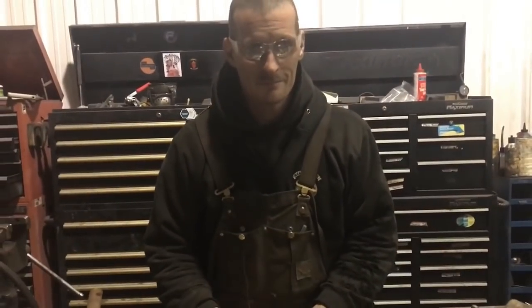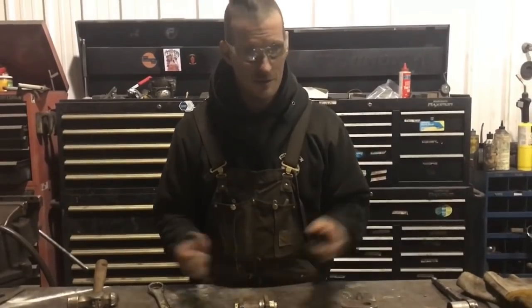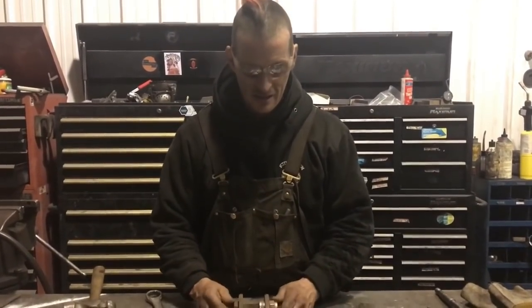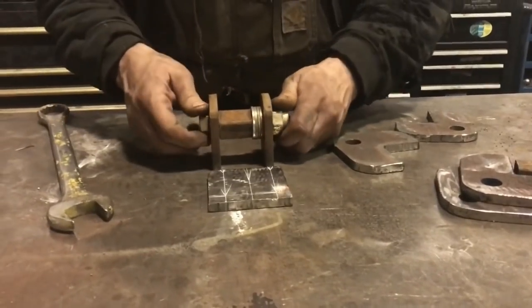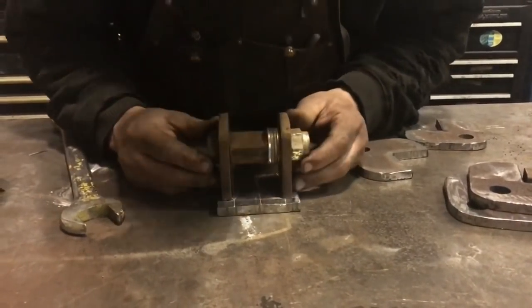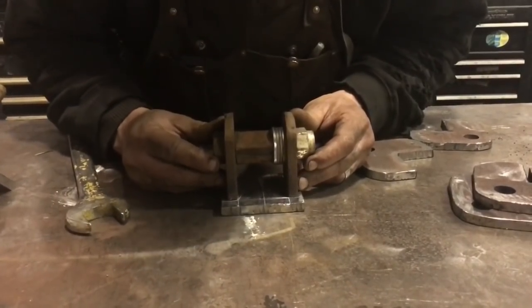Ease of fit up and line up of this bolt hole for our hydraulic mounts for the side shift. I just put some spacers in between to equal out 2 inches, and I bolted them snugly, and now I will set them on their lines and weld them up.